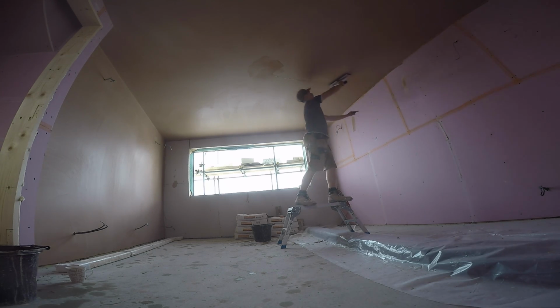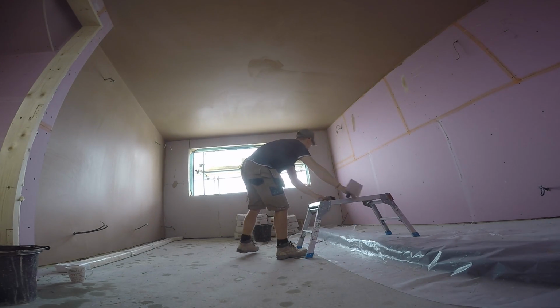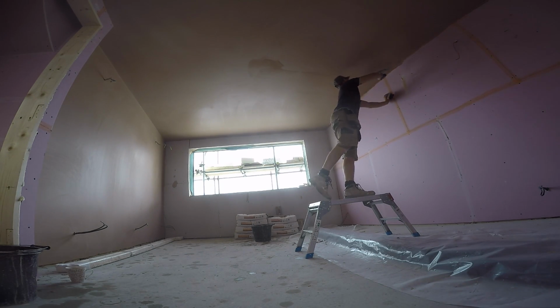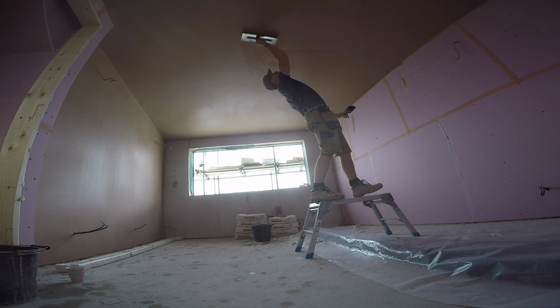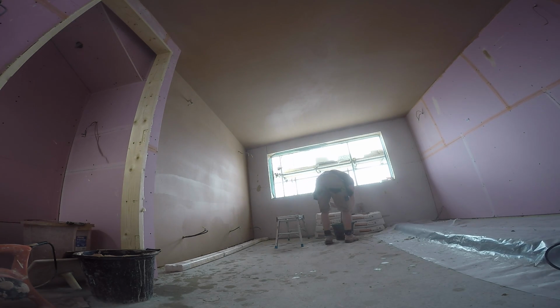They call it a wet trowel because you're wetting the edges, wetting the plaster, and then the next stage you finish with a dry trowel, which means no water, just a nice finish with a dry, clean edge. But yeah, you can see that water's bringing it through, making it easier to finish the plaster, but you're not taking anything off. So this is it, the final trowel over, 2 hours, 9 minutes, no water to the edges now, dry trowel. And that's it, that's when you start getting the results. It's your final polish up.